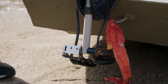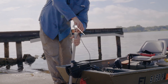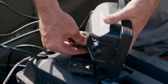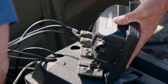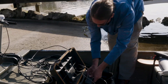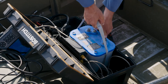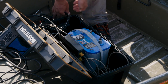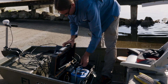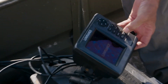About like this is about perfect. We're going to mount the external GPS directly above, and then we're going to go ahead and start hooking up our wires. Our traditional transducer just goes into the back of the unit, while the side scan transducer goes into that Lowrance structure scan box. And then obviously supply power to the unit — with any luck, it'll turn on.